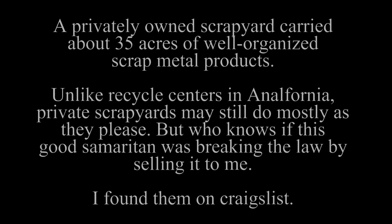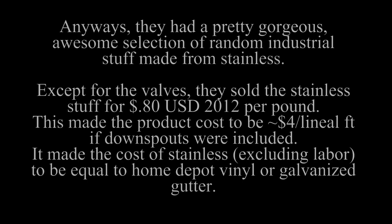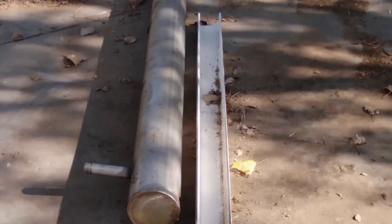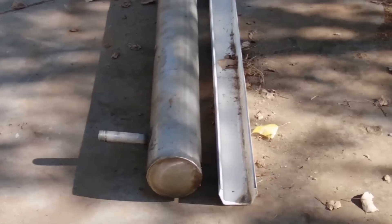You're going to get a pretty much wider pH range with stainless steel. And if you can find stainless steel pipes of adequate diameter to cut into gutters, it may be worth your while to use them. It's certainly going to be a lot more durable. You're going to run into about two-thirds the coefficient of thermal expansion on stainless steel pipe compared to vinyl pipe.